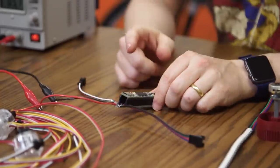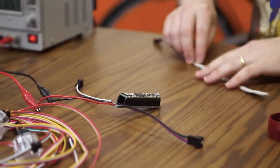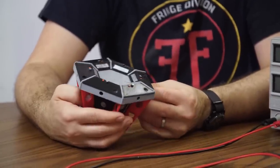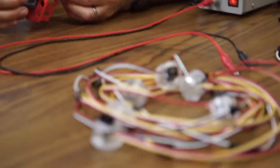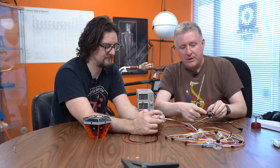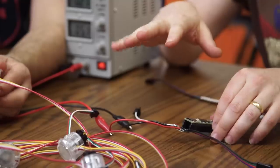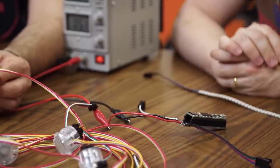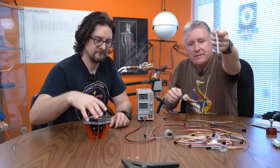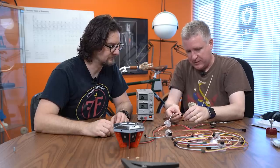The other board that arrived yesterday is the LED board. We're actually running two different kinds of LEDs. For all the panels in front of players — the silver parts — those are going to be APA102s, which is the kind of LED I prefer. For the LEDs inside the buttons, which OtherOcean requested, those are going to be NeoPixels — a totally different technology. Their generic brand name is the WS2812. Both will run from this very powerful Teensy board simultaneously, thanks to some cool new libraries that don't block interrupts. I'd love to plug these in and show you what they look like. They're running through an attract mode right now — if we attach them all daisy-chained they'd turn on, but let's get one working for now.